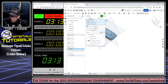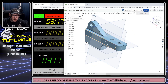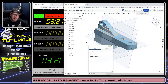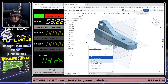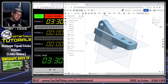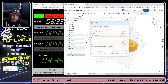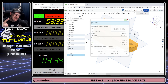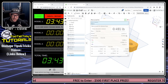Almost finished — one last feature to add. I'll press the S key and jump into the Fillet command. I'm going to fillet this corner and this corner at 0.5 inches. This model looks pretty good. I'll right-click and say Assign Material. I do have a tutorial on how to create custom materials over on the Onshape YouTube channel — I'll include a link in the description.